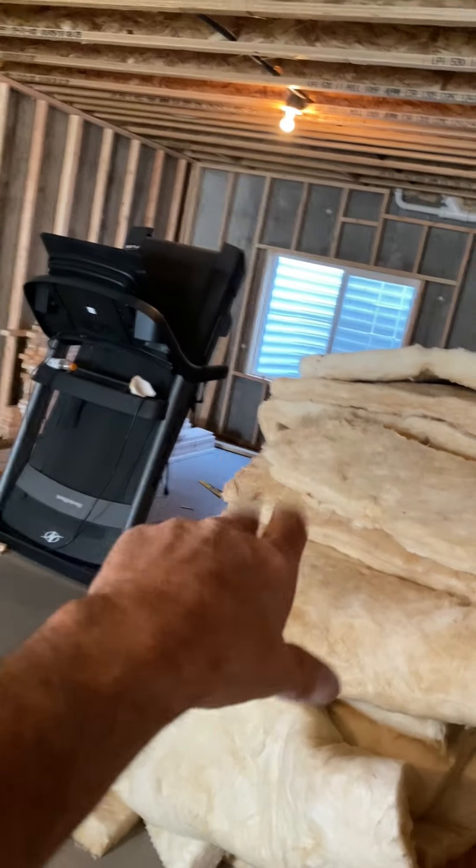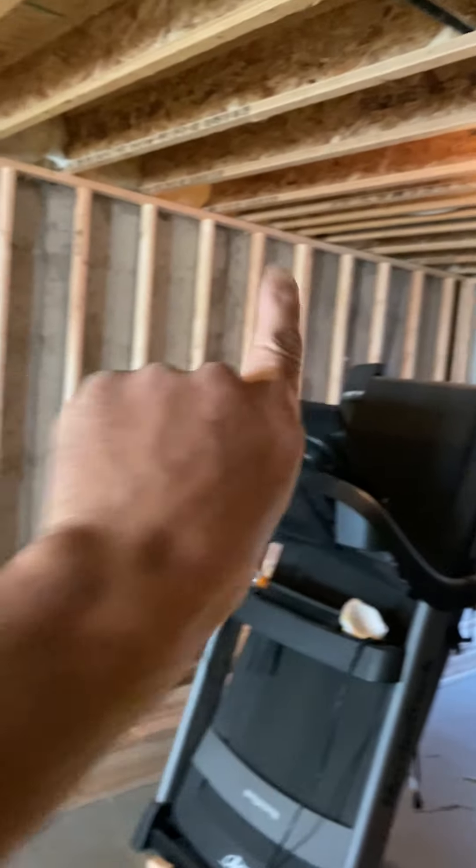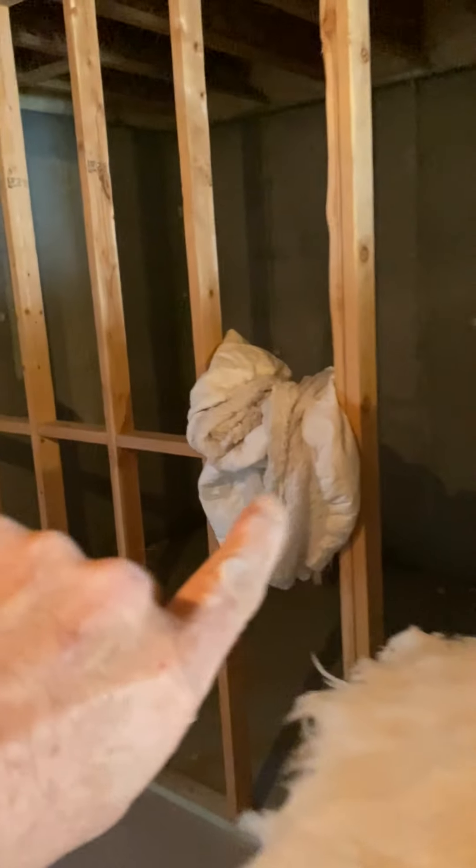This room here is going to be one big room, so there are two 4 by 10 by 6 angle boots in this room and one 4 by 10 by 6 end boot over the window. They're also going to have a bathroom here with a 4 by 10 by 6 angle boot over the vanity, plus a bathroom exhaust. He wants to drill a 4-inch hole through the middle of those so he doesn't have to drop the ceiling since there's a garage there, so you'll need to side-vent it out that way.